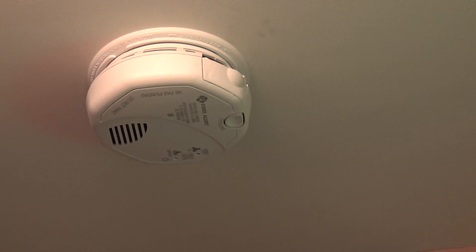Now you know how to test a smoke detector using real smoke — no better way to test it. You can buy artificial smoke in a compressed can and spray it at the detector, or the poor man's way: get a glass jar, put a little bit of paper in it, light it — and by all means have some water around just in case. If your smoke detector goes off when it detects smoke, you know it's working. Thanks for watching.